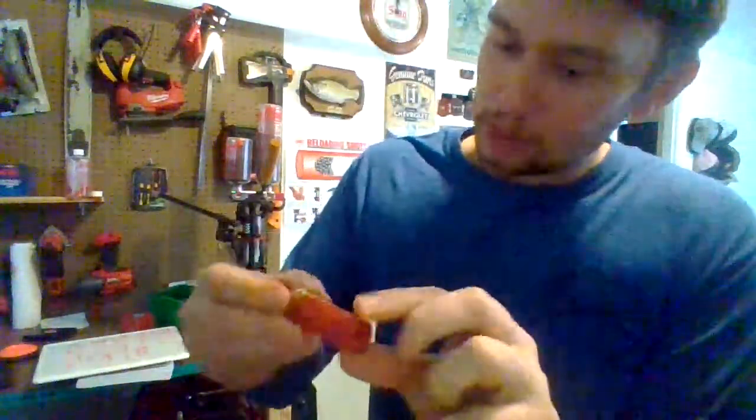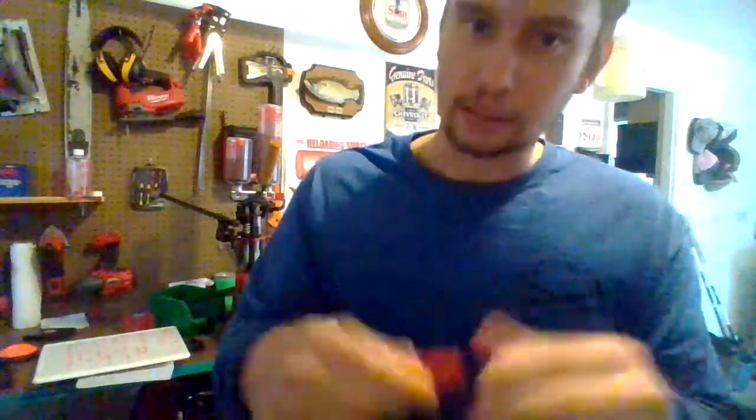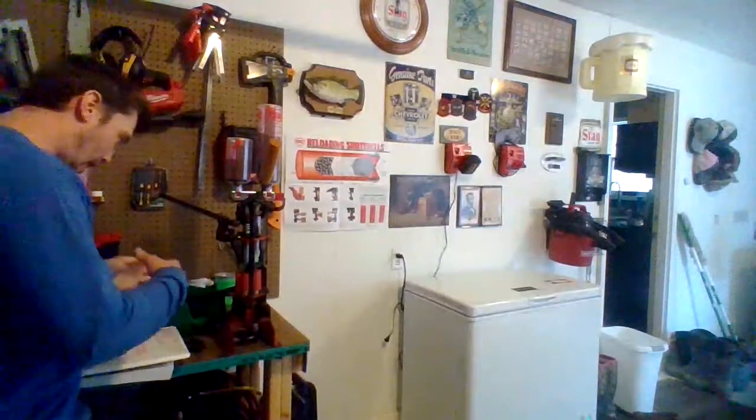This could be a whole different speech — there is no bulging on the shotgun shell, and the crimping almost looks factory. If you gave it to someone who really didn't know anything about shotgun shells, they would think this was a factory-loaded shell, but it's not. This shell was on the last stage of the press. This is a progressive reloader — there are different kinds. The lower end is a single-stage reloader where you can only have one shell at a time. With a progressive, I can reload a box of shells in about five minutes. A single stage takes probably 30 or 40 minutes.